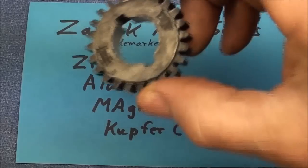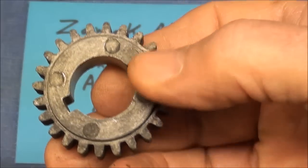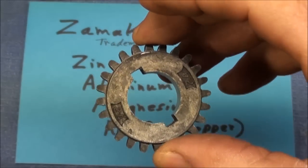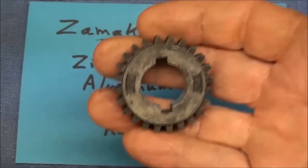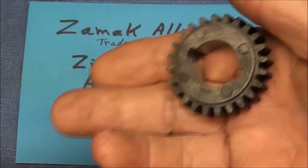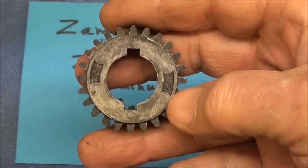These Atlas gears are die cast — they're not cut gears. You can see the four ejector pin marks that press them out of the mold. These Atlas lathes were made much cheaper than Logan and other brands. Just think of how much faster casting one of these coming out of a mold is than making one on a milling machine or on a hobbing machine. It was a fast, cheap, easy way to make gears.